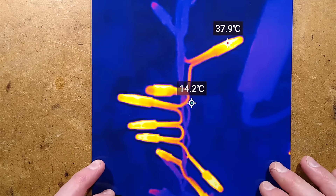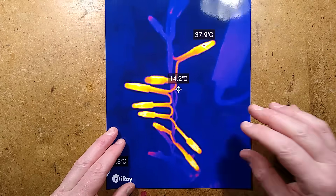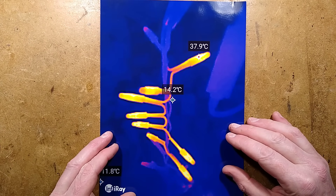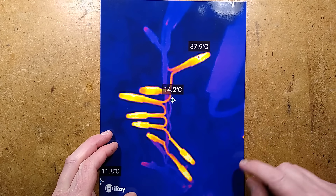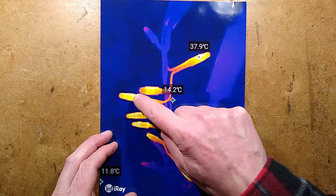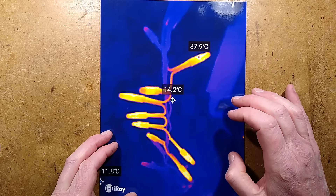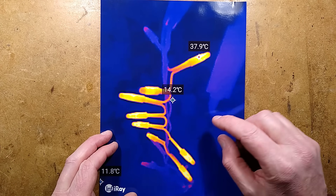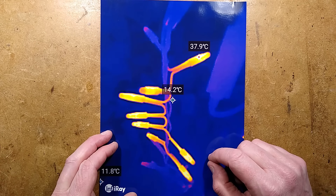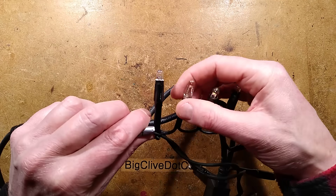Here is the thermal imaging camera image — I'll show it vertically. The glowing ones are the resistors, so we've got one, two, three, four, five, six, seven, eight. The only deviation from that is the last section of the string, which has slightly fewer LEDs — for that one they've used nine resistors just to compensate for the smaller number of LEDs. That also made it very handy to find which one to cut the sleeving off, as I did for that picture.